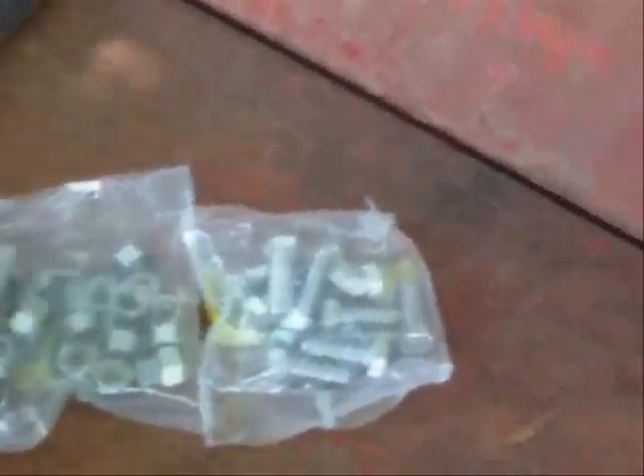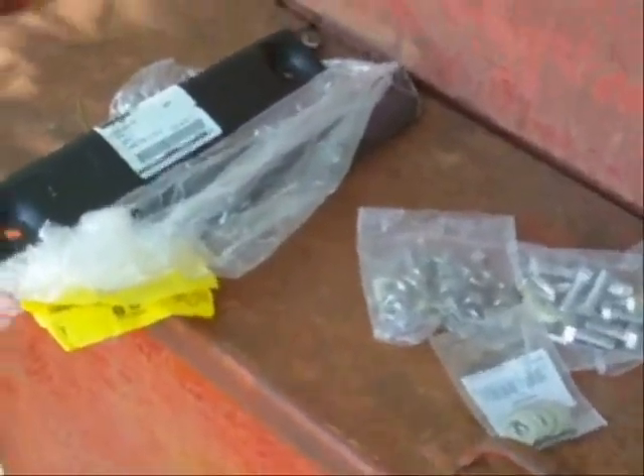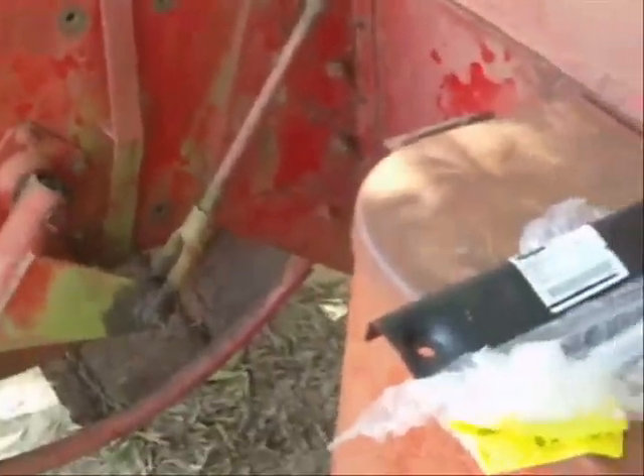I went the other day and got some stainless steel hardware — bolts, nuts, and washers — and then I got some hay stops. The reason I bought stainless steel was because the last time when I took the old ones off, they were so hard to get off the heads were torn up on them. So I figured stainless ain't going to corrode as bad, and if I ever have to take them off, they won't have near as much trouble.